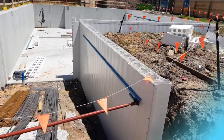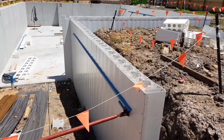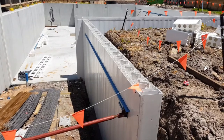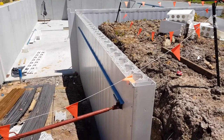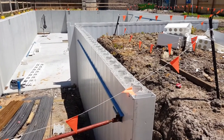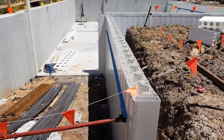It'll be an opportune time to show a new product which is gaining popularity in the basement construction area — a pre-formed plastic void which is called a Dincel wall. It basically is a series of plastic or PVC channels which slot and interlock with each other, creating a void which is filled with steel and concrete and actually becomes an in-situ retaining wall.